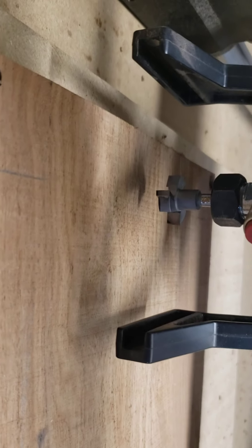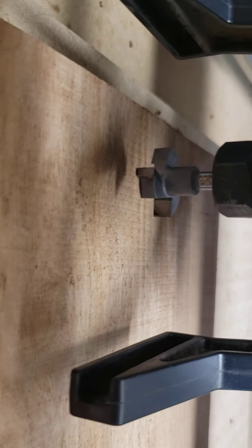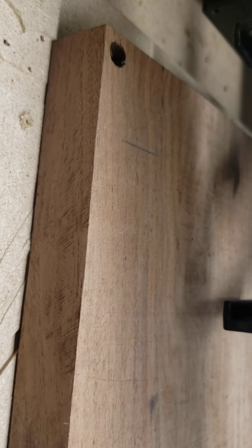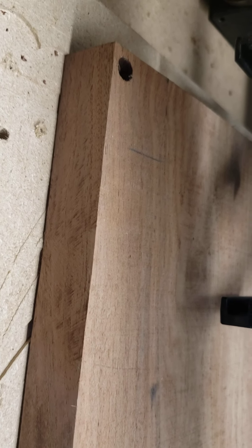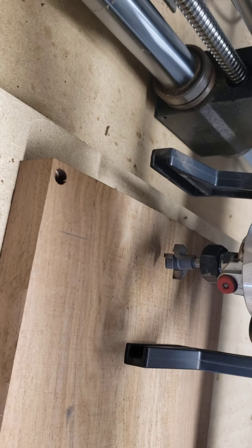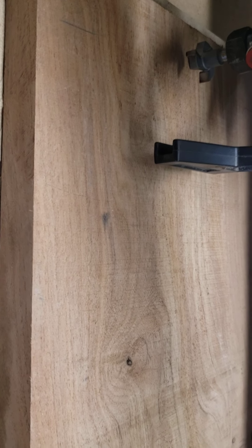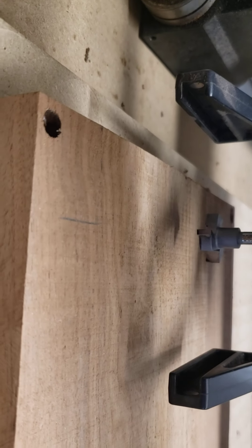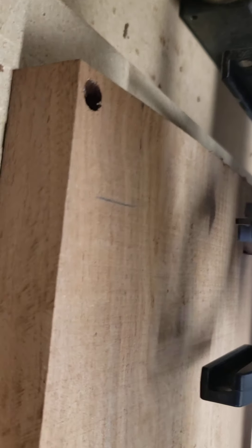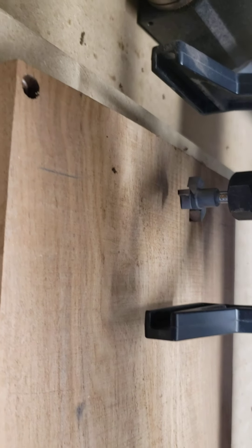When I do my surfacing, it's going to start at that height, so the first pass it's only going to take a little bit off in the middle and the rest it'll miss until it gets to that depth. By doing that, you're not going to hit a pocket where you'd be three times as deep if you had started back in the corner where it's really low. I'll probably run this code two or three times because I don't like to set a deep depth. It's a shorter code — you just go back to zero, reset your Z height, and do it again. Takes maybe ten minutes tops to flatten both sides of this board, and then I have a perfectly flat board I can put back down and cut my project. Hopefully this gives a little more information for new people starting out with this machine. Don't be scared, just take your time, practice, and anybody can run these machines once you know your feeds and speeds. Take care, guys.